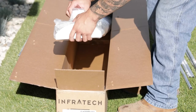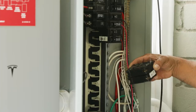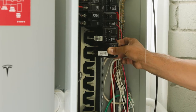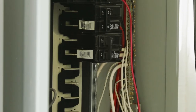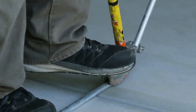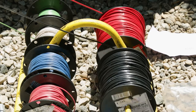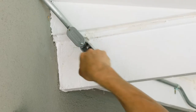The installation starts with shutting off the main power; you then select where the heaters are going to be placed. From there you'll locate the main power panel for the heaters, the control panel, and then install any switching that is going to go along with these heaters. You would then run conduit to the heater locations and pull wire through those conduits to feed the heaters.